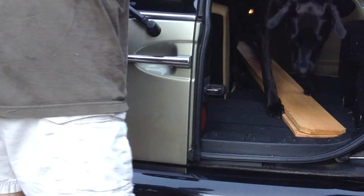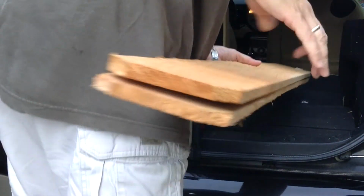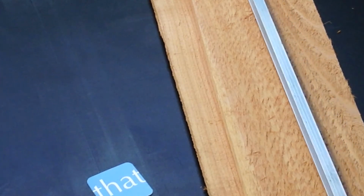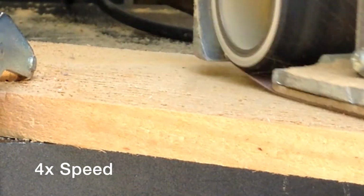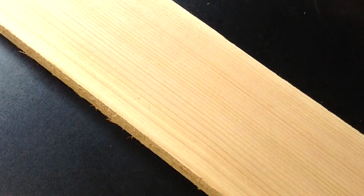So, Lacey and I returned from the home center with 2 rough cedar fence pickets. As this project is an experiment, I really didn't want to go overboard on supplies. Cedar is generally a good choice for outdoor projects, and I also grabbed some aluminum U-channel to use as a post. Cedar fencing has a coarse face, which adds visual interest, but it requires sanding to provide a proper surface to accept glue. I sanded one face, and the fronts would remain rough.